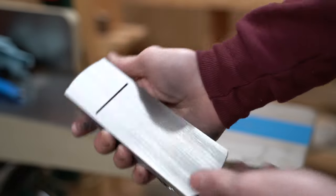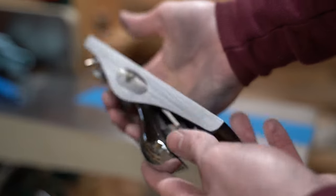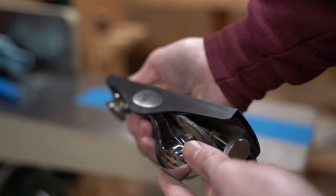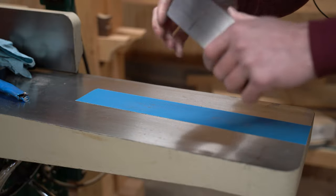I've officially gotten rid of all the previous scratch pattern and the sharpie, and as you can see that is nice and even. I've also hit the sides as well. You can take this all the way up to 2000 grit if you wanted to, but for a block plane that isn't meant for a finishing pass, I wouldn't really find the need.